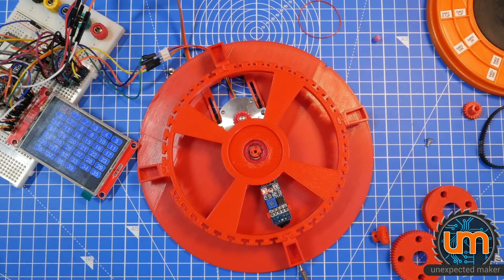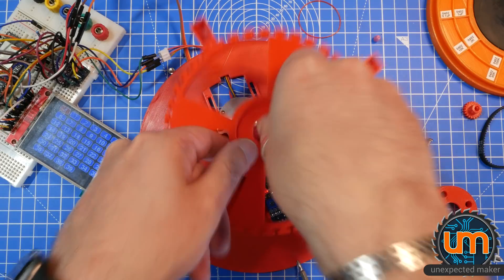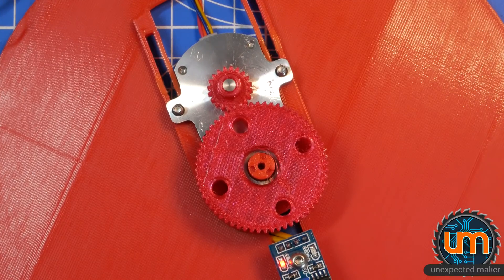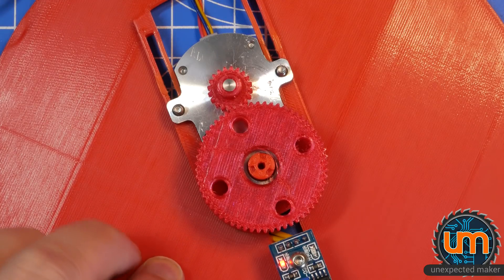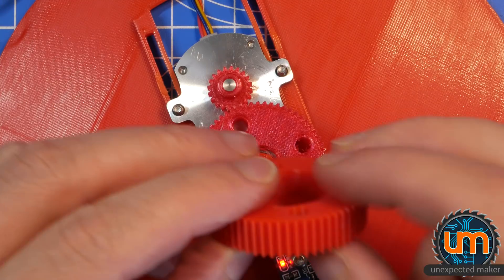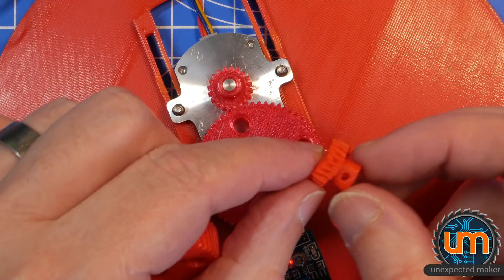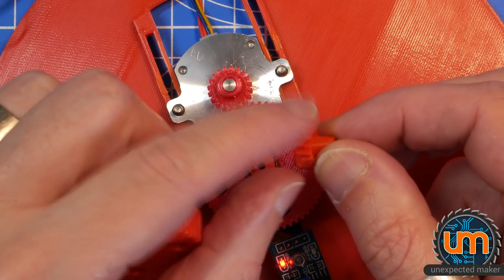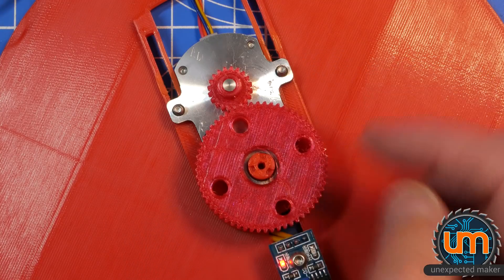How did I do it? Well, a lot of frustration. What I've effectively done - let me see if I can get this off, it's press fit but it's super tight - I'm using gears now, which makes things a little bit noisy. I know people mentioned I should use gears from the start. I wasn't sure I could print reliable gears, and to be honest they're not fantastic. My PLA gears looked a little bit nicer than the PETG, but the small gears were starting to wear already with some rubbing, so I thought I'd better redo this with PETG. It's a much stronger, sturdier filament.